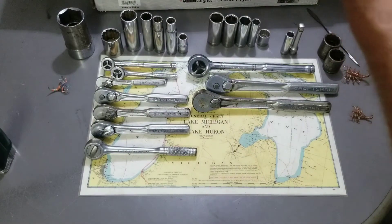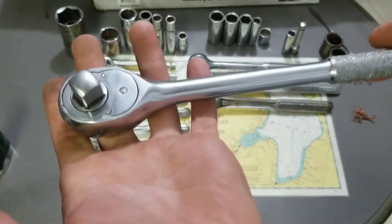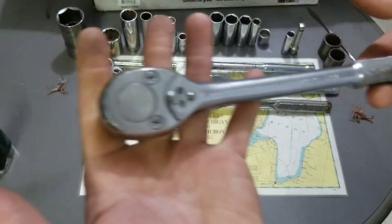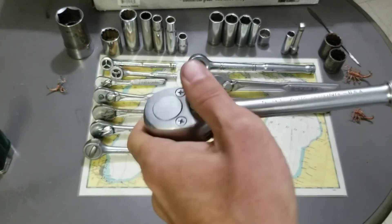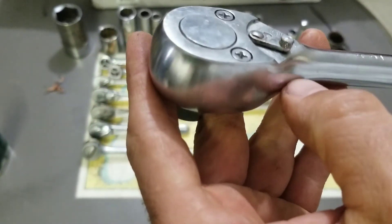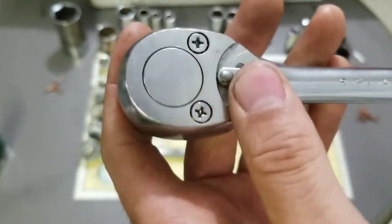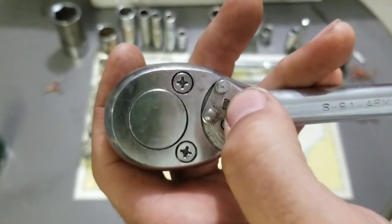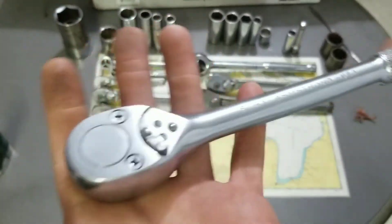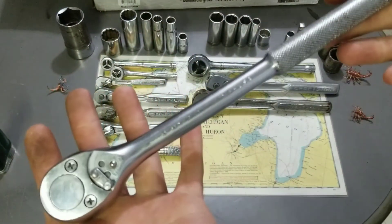That's it for Craftsman half-inch drive. This next ratchet is pretty cool — I don't come across these too often. It's an Armstrong S91 in really good shape. The only thing I don't like is the selector lever — it feels like a weak point, and it's got this detent ball with extra moving pieces that are prone to not working if dirt gets in there. But it's a nice-looking ratchet and the rest seems fairly well built. I might put that one into service.